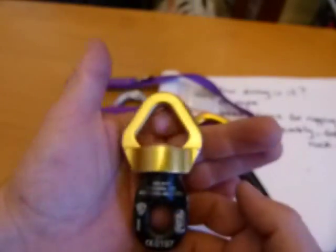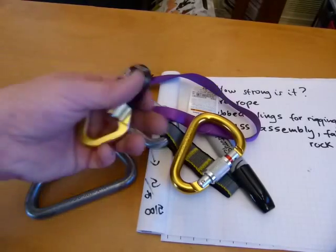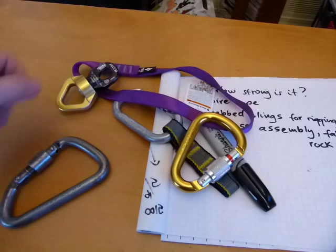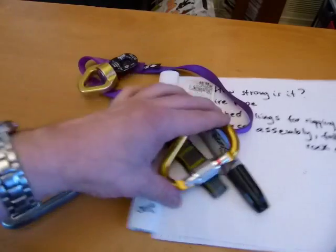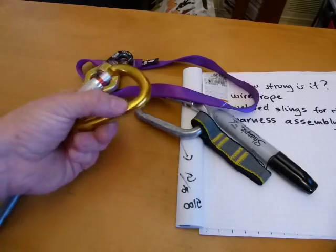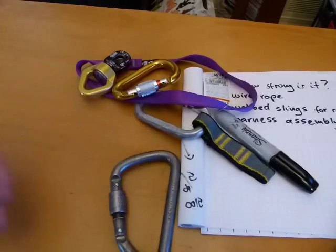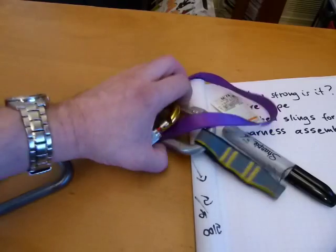That ice swivel works — rock climbing gear can also work in construction. But these lightweight aluminum pieces abrade easily on contact with concrete — if moving against concrete, they'll wear very fast. The steel hardware is much heavier but better suited for construction. For rock climbing you want to pack light, so aluminum is used there.